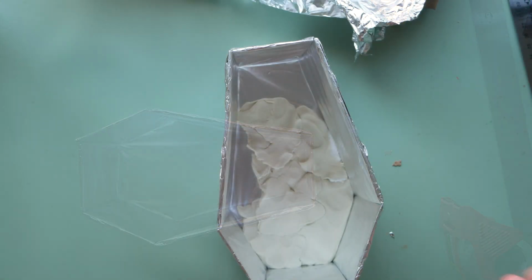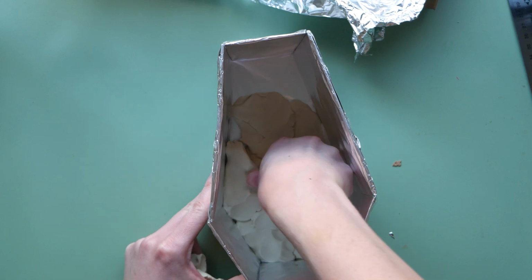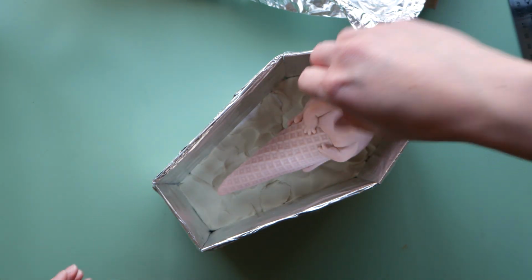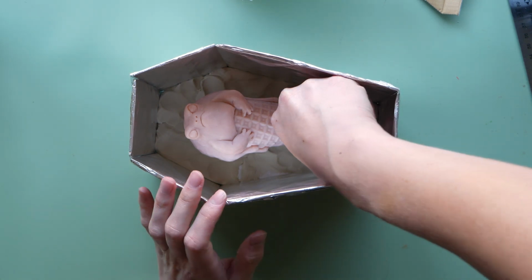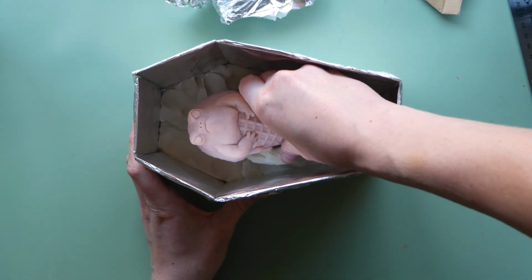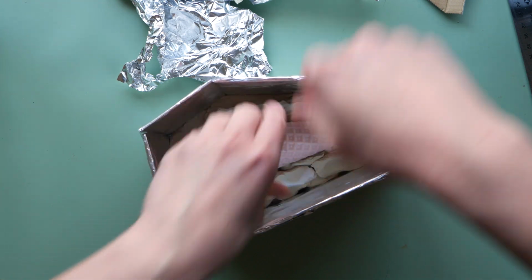The next step is filling the bottom of the mold with sulfur-free clay. Again, if you're going to do this yourself, you should watch the tutorials from Smooth-On. I'll do my best to explain what I'm doing, but it's not my area of expertise. But basically, you want to surround half the sculpture with clay and fill the rest with silicone to make part 1 of the mold. And then you remove the clay and fill in the rest with silicone so that there's two separate pieces of the mold. I made a layer at the bottom, put the frog in, and filled the rest up to the halfway point.